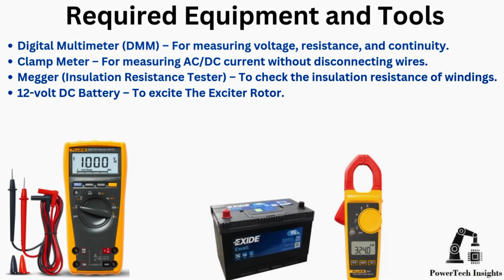Required equipment and tools. Digital multimeter for measuring voltage, resistance, and continuity. Clamp meter for measuring AC/DC current without disconnecting wires. 12-volt DC battery to excite the exciter rotor.